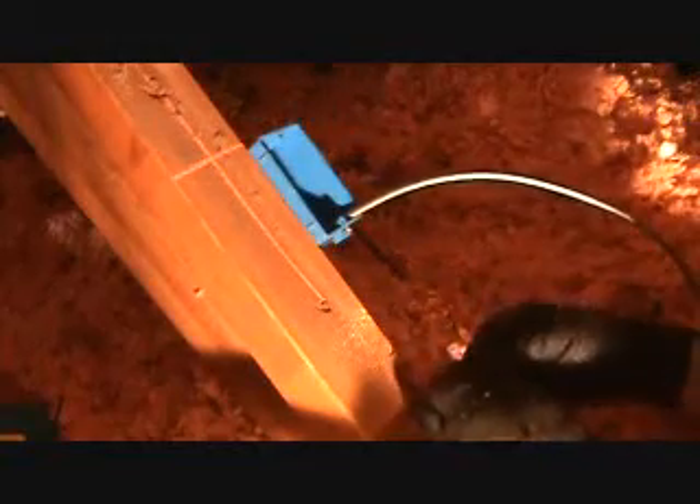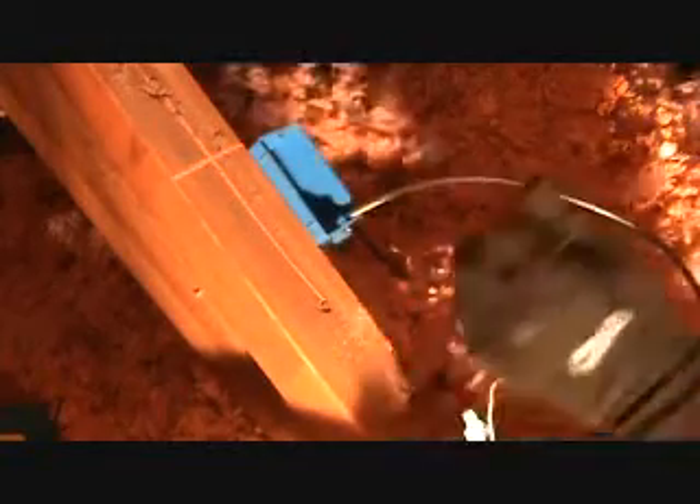When I took the existing wire off out of the junction box over here — that's where the junction box was — I loosened up that other wire. That cable right there is not long enough to come over here, so I'm gonna have to put another junction box over there and put another wire connected to that and come from there over to this box.